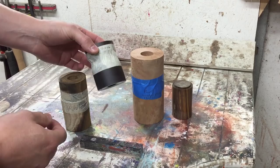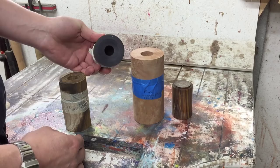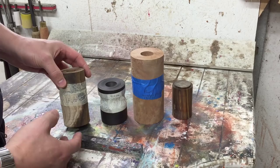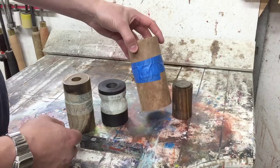This is African blackwood — a tricky one. I love working with it and making boxes from it, but it's so heavy and dense it takes so long to season. This was January 2014, so it's nowhere near ready. You have to take that into consideration: something like laburnum, ash, oak, or beech will season a lot faster than something so heavy, dense, and oily — like African blackwood, cocobolo, or lignum vitae.